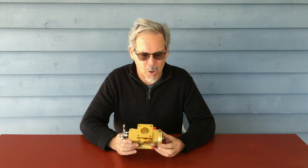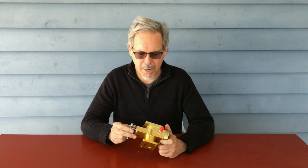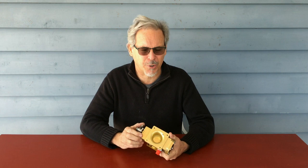This is a well-proven carburetor — it's been out for a long, long time. But in recent years, it's had two very significant modifications. One, it has the ability to shed fuel vapors, and very importantly, it has this button right here that allows the diaphragm to release the pressure inside. This functions as a primer amongst other things. This is an excellent carburetor and it does have full authority mixture control on it.